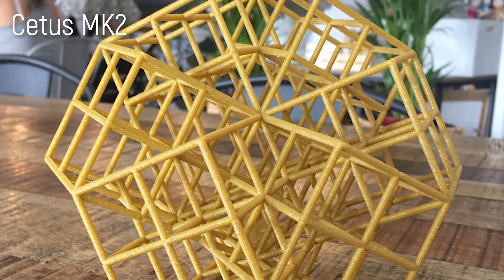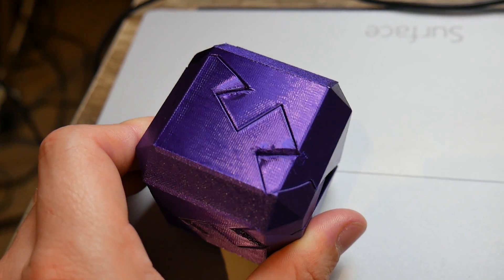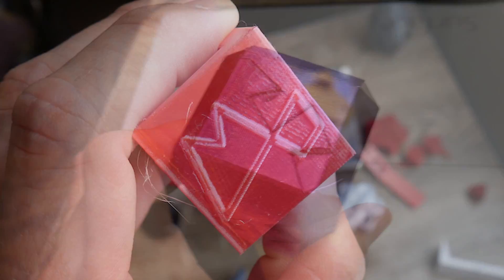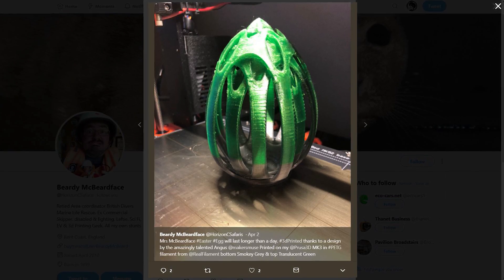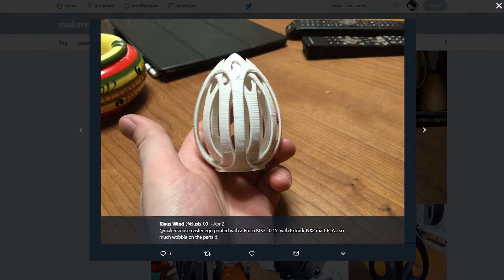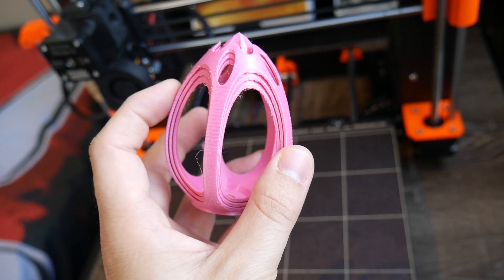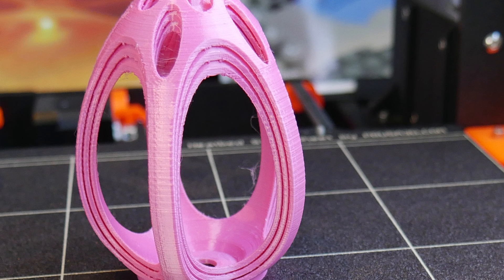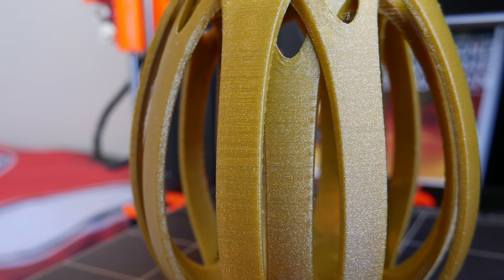For almost everything else the Mark III has been pumping out great looking prints, and I can't stress just how good it is to have a removable print surface when doing product prototyping. The parts do have a unique surface finish on the sides, most noticeable along flat sides. I threw my ghosting test at the Mark III and the ghosting is minimal, though there's a small texture there and I'm not exactly sure what's causing it — maybe the drivers, maybe the linear bearings. A lot of people printed my Easter egg torture test on their Mark III's and experienced a wobbly artifact on the outside surface, and I did get the same issue with the same artifacting at the 0.15mm slicer preset.